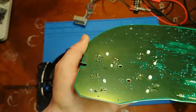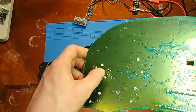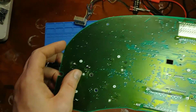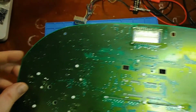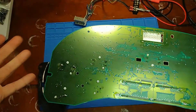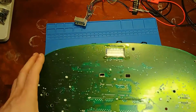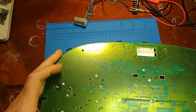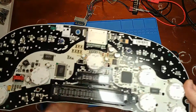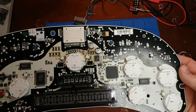Here I see the typical do-it-yourself solder globs and jumpers from pulled, ripped pads. Come on, people — stop pulling pads, really. It's not that hard. You just get out your solder sucker, which is all of $10, and you make sure you move the solder before you grab ahold of the stepper motor and rip it out with all of your might. I've seen too many of these.